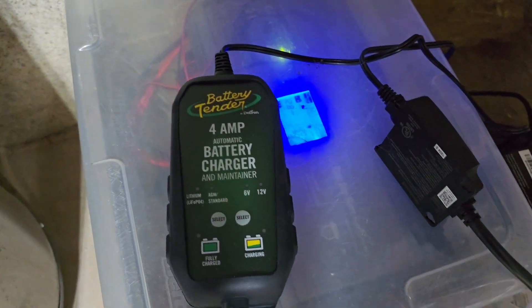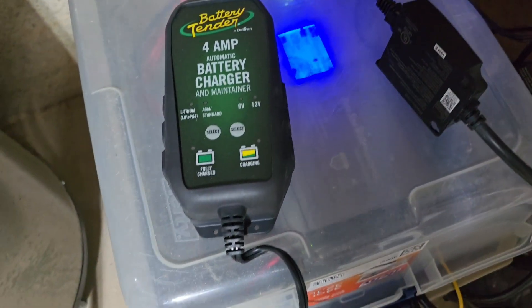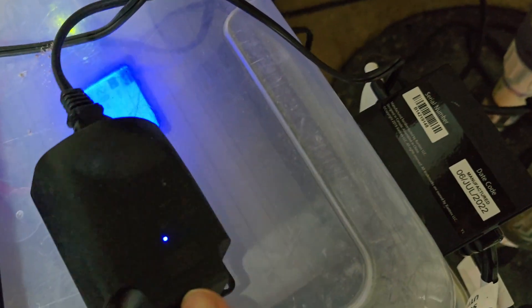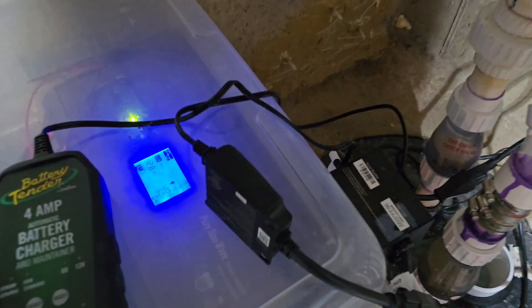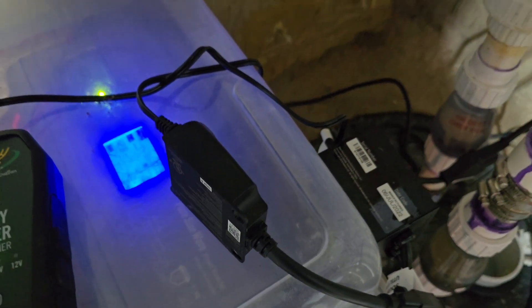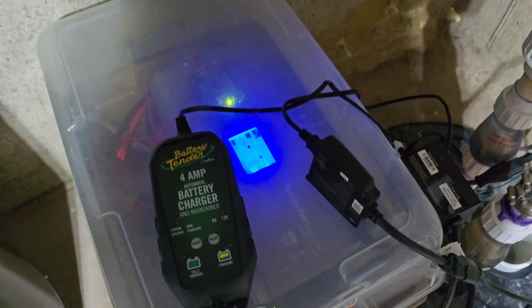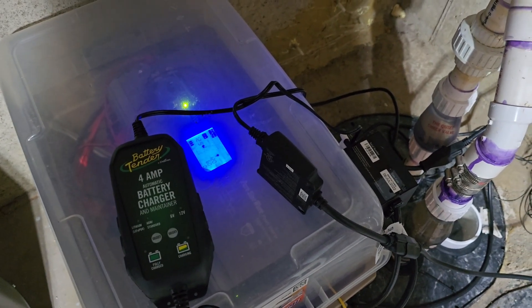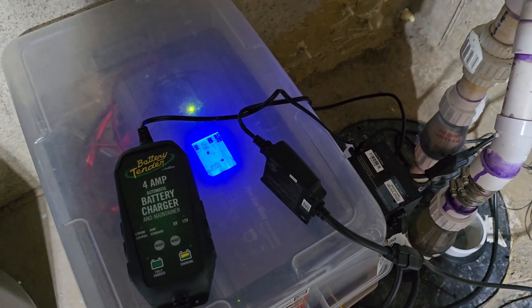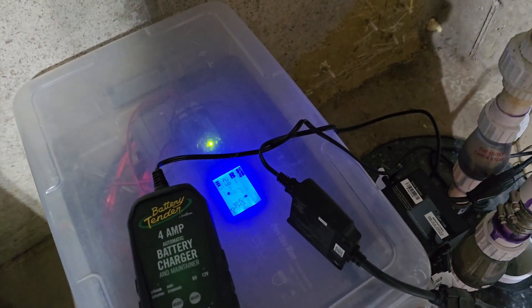For charging, I have a small charger to help keep the battery healthy — I don't want to charge it rapidly. This charger is hooked up to a z-wave switch, and I have it basically top off the battery when there is rain in the forecast. A z-wave rule checks the rain forecast, and if the chance of rain tomorrow is high it charges for five or six hours. If there's no rain forecast, I have a periodic two-hour charge about once a week just to keep it topped off, because you don't really want your battery sitting at 100% indefinitely.